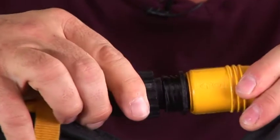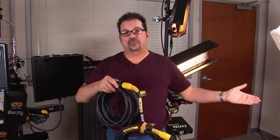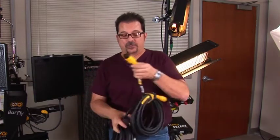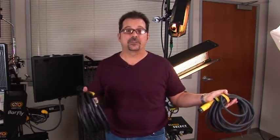You can take a typical 25-foot cable and daisy-chain them up to 75 feet with a single, double or four-bank. You can run them straight to the fixture, or if using a splitter, run the cables from the ballast and put the splitter on the end of your run.